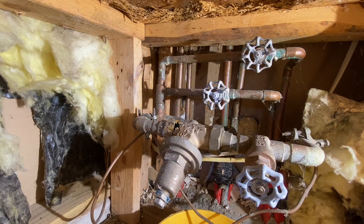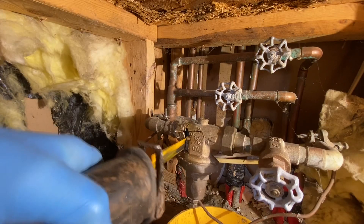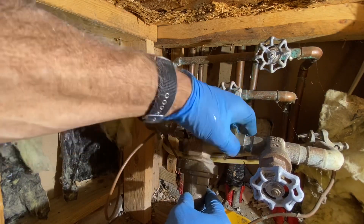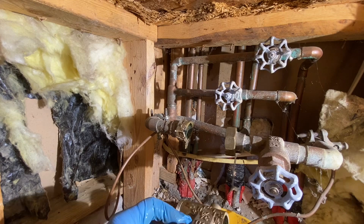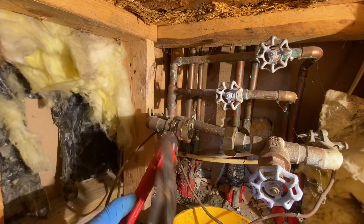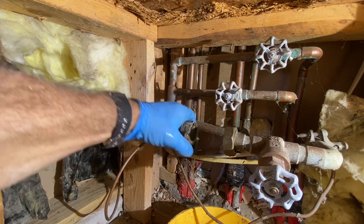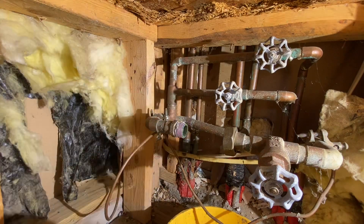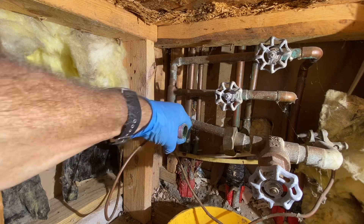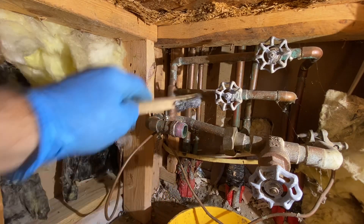We're going to go all the way through this valve until it is literally cut in two pieces so we can get it out of the way. Fortunately, for the last little piece on the left that we're about to see, we did a good job not cutting all the way through the valve body into the threads of the adapter. So when it comes time to replacing it, we're going to have great threads to work with. Now it's time to clean these threads off so we can apply some fresh Teflon tape and thread sealant to get ready to get our next PRV in here.